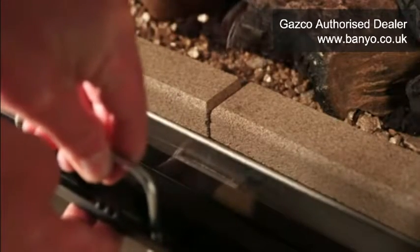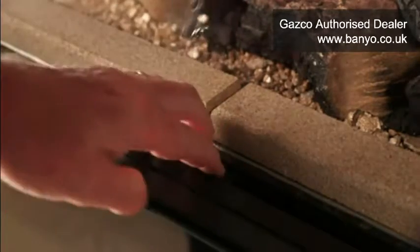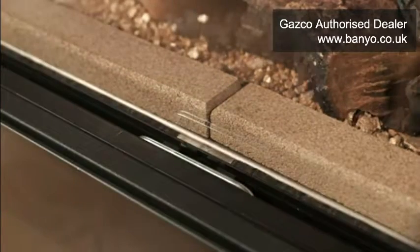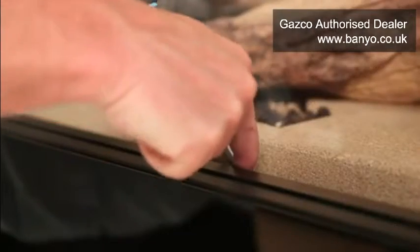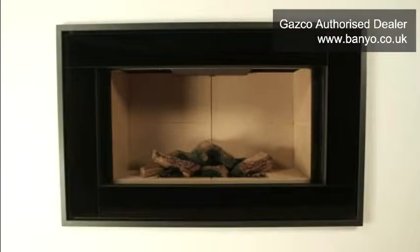Lower the panel slightly to check that you have hooked the top of it back into place. You will now be able to hold the handle at the bottom of the glass panel and use this to manoeuvre the lower part of the panel over the lip of your fire. When this is done, lower the whole panel down into its allocated slot. Replace all the screws, taking care to ensure they are affixed firmly. Replace the bottom screws first before working your way up the left and then the right-hand side of the frame of your fire's glass panel. It is important to the proper functioning of your fire that all screws have been returned and secured.